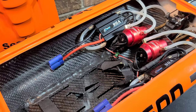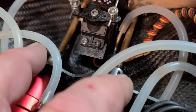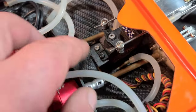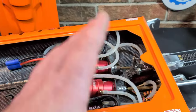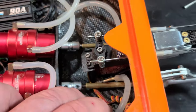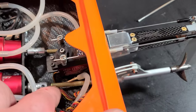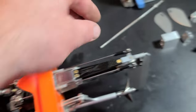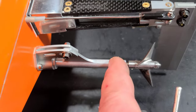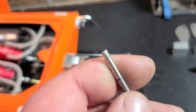I'll run these packs for a couple of runs but I'm planning on getting some 3200–4000mAh 4S packs. We'll also try it on 3S. Running 4mm flex cables with an OSC coupler — I'll probably change these out to a collet soon. When I went to cut the cable down, I had to trim about 5mm, and of course the right-hand cable unwound on me. I have plenty of left-hand cable but not right-hand.